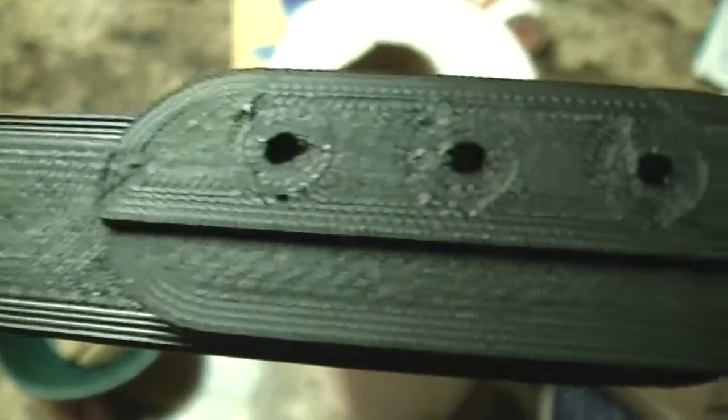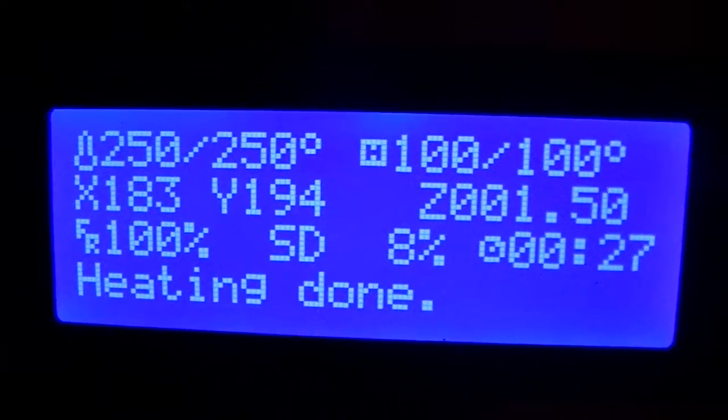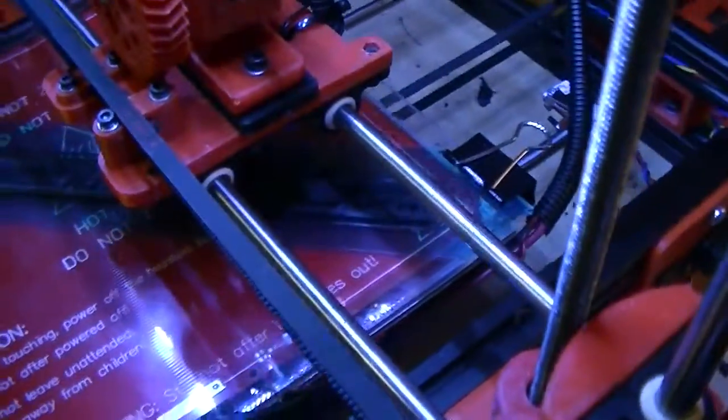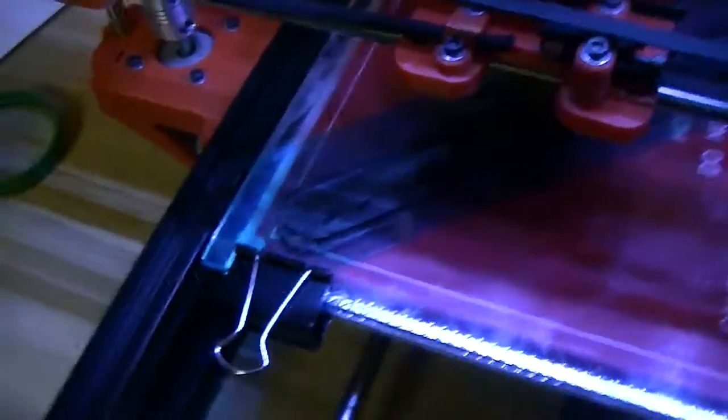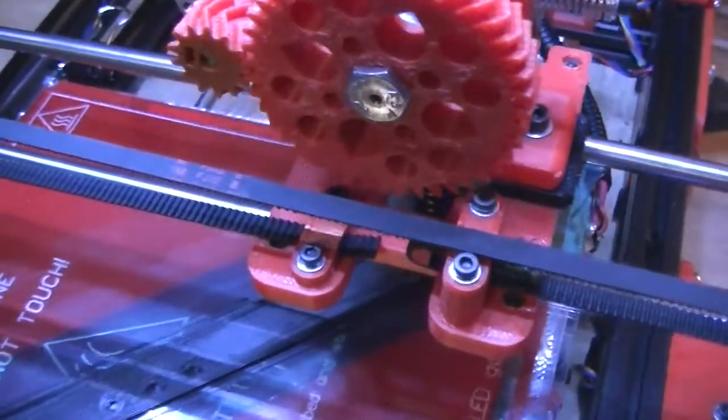My finished pieces have some fairly nice tops. So that's with the flow set at 90%, and I can tweak it as it's running — I can change the speed, the flow rate, bed temperature, nozzle temperature, all that sort of stuff. But I wanted to get this in just to show exactly how I'm gluing things down. It seems to be working very well. There's nothing else I want to add in this video — I wanted to make this a quick one just regarding how I'm getting things to stick down, how I got past the curling up the ends issue.